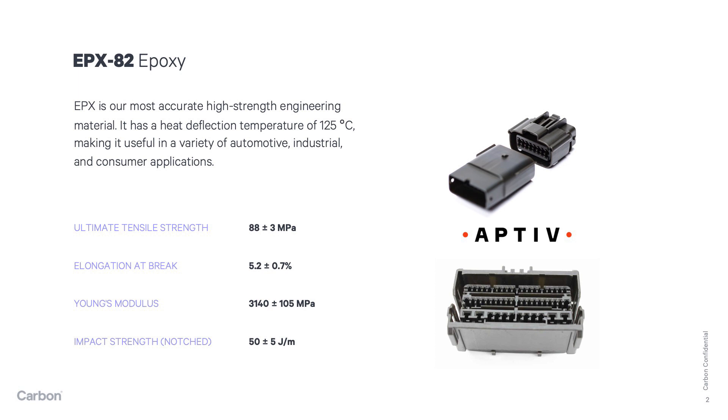You could take that two-part epoxy, blend it with a UV-curable component of your formulation, and now you have something interesting — you can first UV-print to form the shape of a part, and then activate that thermally curable network in an oven. In this case, that epoxy network results in a part with very different properties than if you were to use the UV-curable material alone. It really gives us a broader space of formulation to generate resins that solve specific problems.